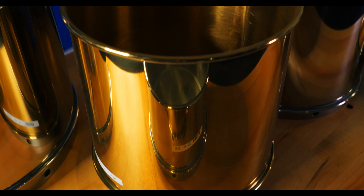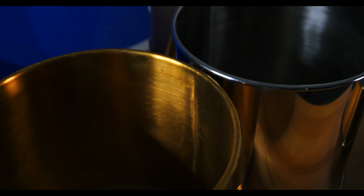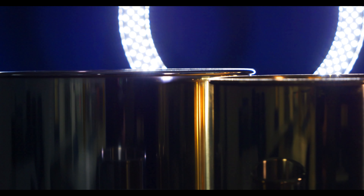Sometimes your industry standards will require you to have your test sieves certified or calibrated. This means you need documented proof that your sieve meets your ISO or ASTM specifications. Basically, your test sieve is run through a machine that verifies the size of the openings, and your sieves are returned to you with a document confirming compliance with required specifications. Certification can be done on a brand new sieve before it's used. After sieves have been used for a while, they can become stretched or damaged and need to be sent back to be recertified, ensuring they're always performing at their best.